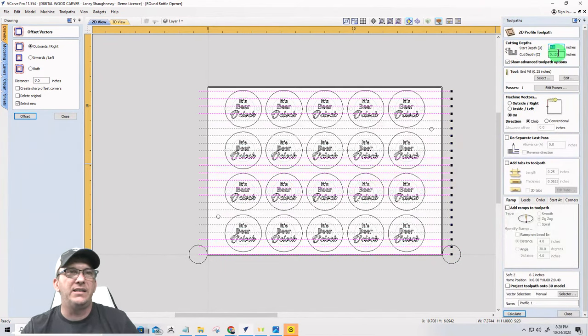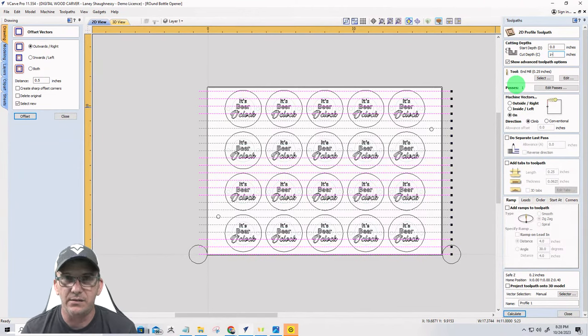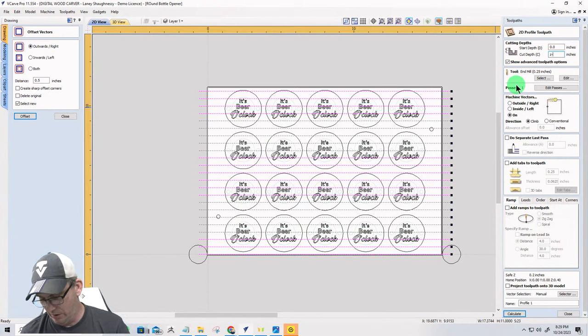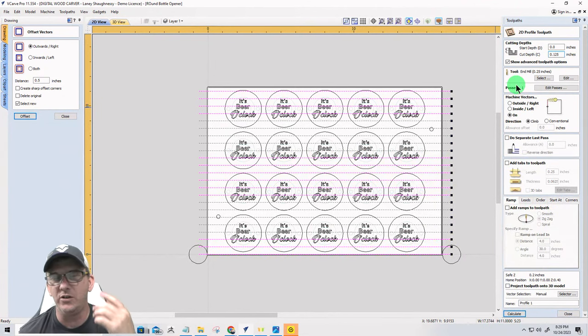It's going to be a profile cut. I'm going to be taking off some of my board width, which is Z equals, all right, so that's my board, 0.75. And I'm going to take that Z and subtract what I want to keep. I want to keep 5/8 of my board, so 0.625, and hit equals. So I'm only cutting 1/8 inch deep. I'm just doing the math. You could do it in your head. You don't need to type it out all fancy like that, but you can. That's what the software is cool about. Z or T, Z for Z axis, T for thickness of your material, minus how much you want to keep equals how much you want to remove.